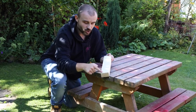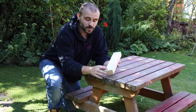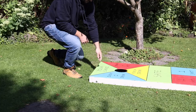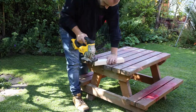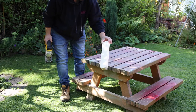I'm going to cut a couple of curves on the corners of each leg, doing it on both sides. At the top of the leg, the curve will enable it to pivot when it's in the framework — we're going to have a bolt going through the middle. On the bottom of the leg, the curve means it will sit flat on whatever the surface is. If you do a straight angled cut and that angle is wrong, it ends up sitting on a narrow point, so a curve is a much better option. I'll then sand that to make it a nicer curve.